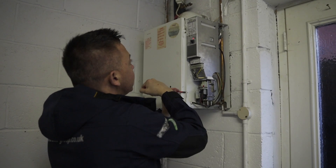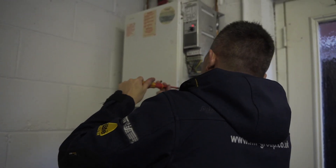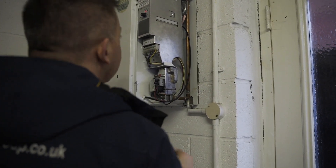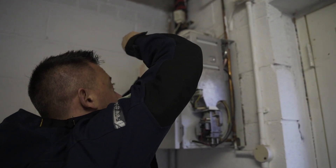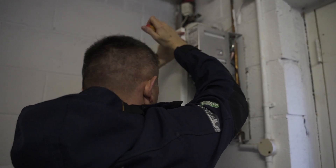I personally think there's an issue. If the fan is spinning and has power to it, we just need to check that. In this boiler I'm 99% sure there's an air pressure switch that gets triggered from the fan, so it won't fire without it. I don't think it's to do with these - when I listened and put my head to it, it was showing issues.